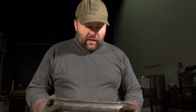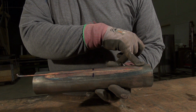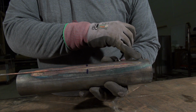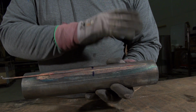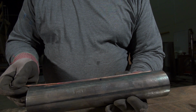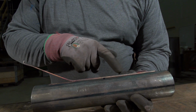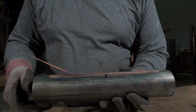This is the first tube that we soldered. It was filled from this end down to this line here with this silver solder material we are using for this experiment. This soldering material melts at 650 degrees Celsius, and it has a tendency to creep very well along surfaces when it is hot and melts. So from what we can see here, it seems to indicate that the soldering material ran down to this point and then no further. From the rest of the soldering, it seems to have decent contact everywhere, and it's not going to fall off this test tube.